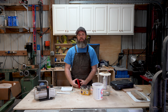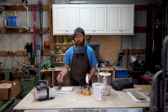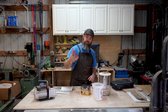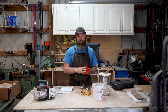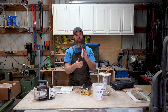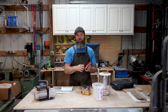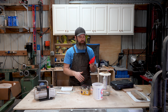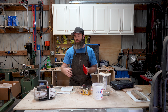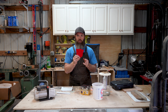What's up everybody, this is Adam with Reese Customs. If you have something you 3D printed and you want to make copies of it, the best way to do that is with a silicone mold and epoxy. This is something I designed and 3D printed in Fusion. It's white PLA, but it's red because I primed it with several coats of sandable primer and then painted it so it would be smooth. Whatever the surface looks like on the piece you're molding, the final product will look like that also. The silicone takes a very good copy of your piece.